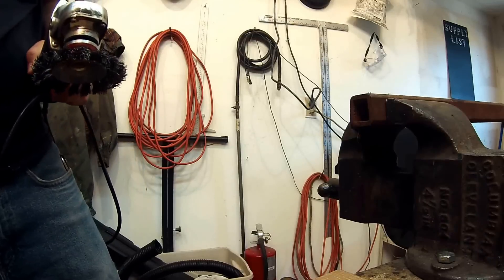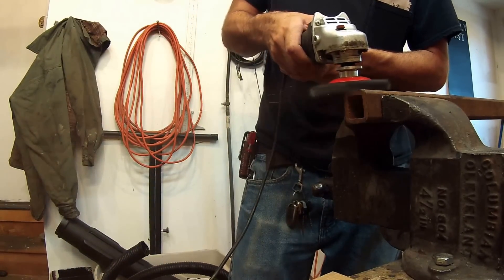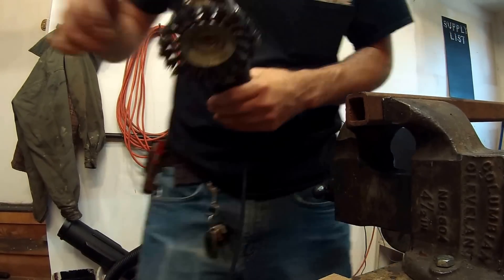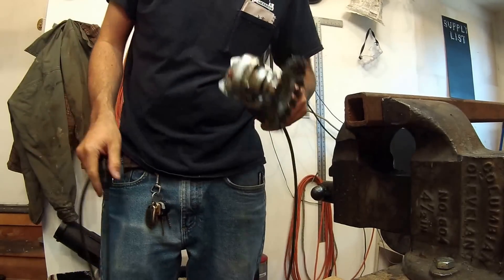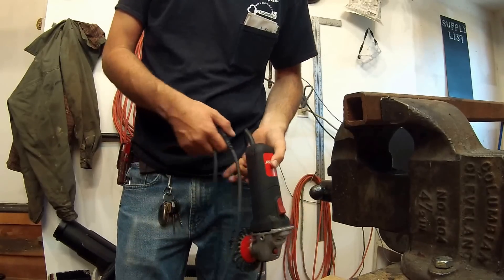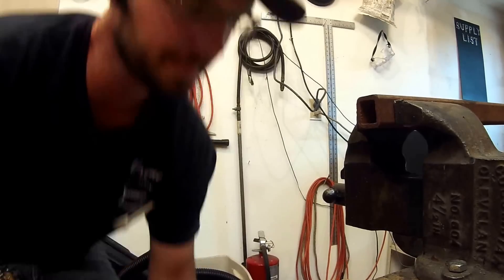This grinder is probably about 9 or 10 amps. Your DeWalt grinders and higher-end grinders are probably going to be about 12 to 13 amps — that's going to be about the limit on these. Once you put it under load, it cuts out — it quit, it didn't want to do that. So you've got to reset: turn it off, unplug everything. The difference is running tools versus running them under load. As soon as I put this high-amperage grinder under load, it's not going to run. Right around 8 amps is about what you're going to be able to run with this.